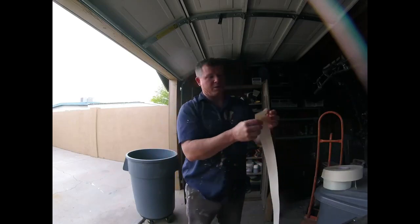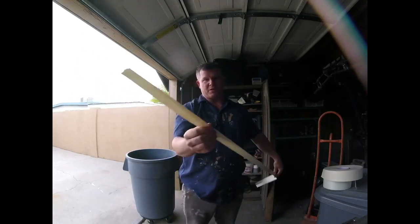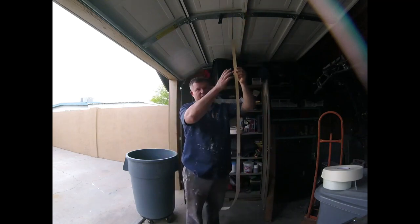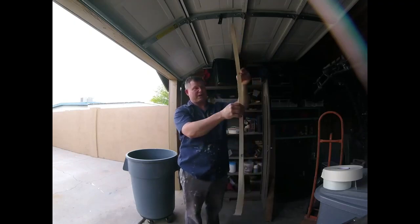Like when we do a round wall or angle, I like to use paper tape in angles. You can still use fiberglass, but the paper tape, you can crease it like that, and then you can use it in the angles of sheetrock whenever you have an angle. So on the angle, you'd have to put mud, strike each side of it, the 90-degree angle, and then you'd have to do the tape, and then you'd have to trowel it down with your knife.